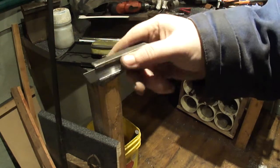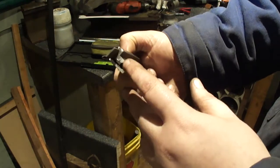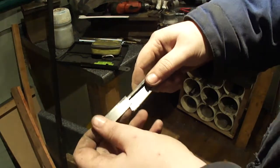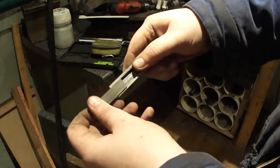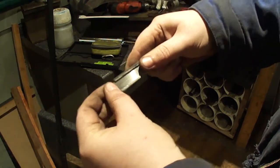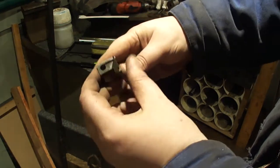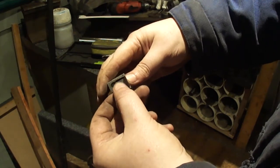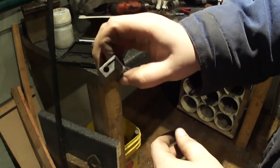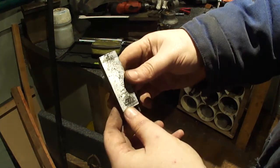I finally got it. I had to split it with the angle grinder because I couldn't get a good way to hold it in the saw, which is not my best work, but it holds very well. See, it's too big because of the dovetail, but you slide it in from the end and it holds it. When he clamps it down in the turret tool post it will actually clamp this thing tight and lock it in place. I just draw filed a lot of the sides and got it all cleaned up for him.